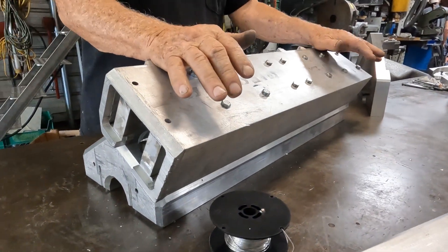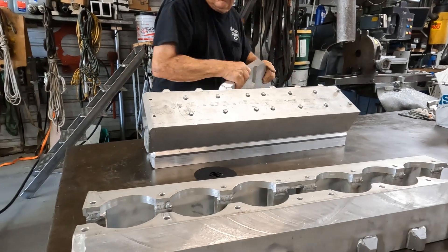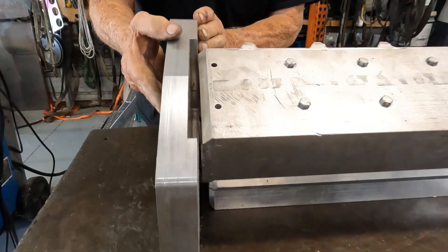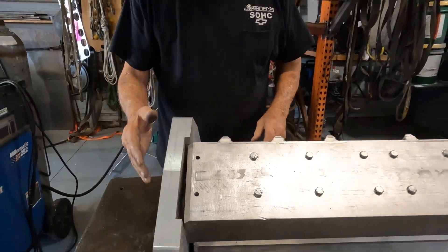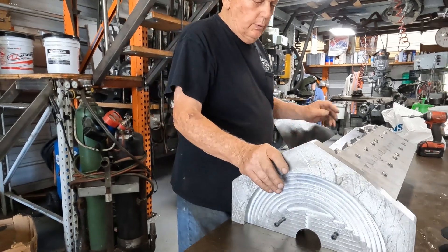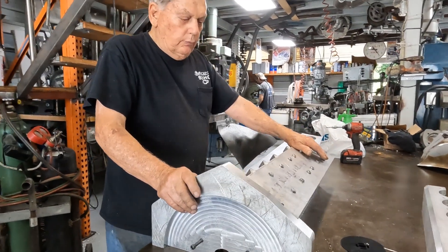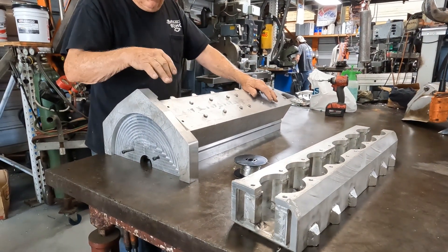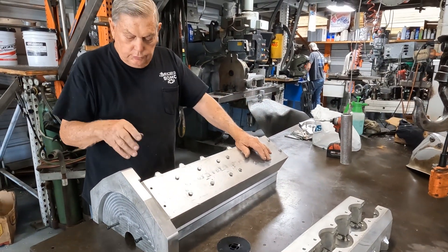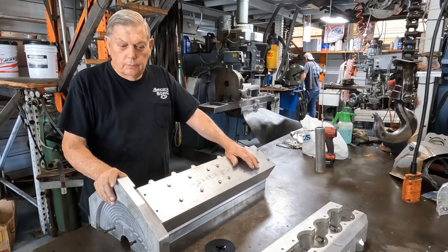That's about here, just like we did in the two-liter. Then you're going to send it out and get it heat treated after that. After it's heat treated, it's line bored and we'll machine everything — we'll bore the holes for the sleeves, the head bolts, the crank — everything machined back square.